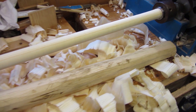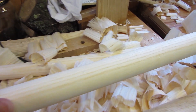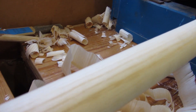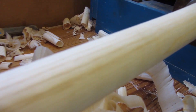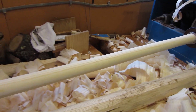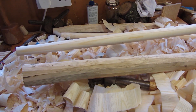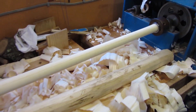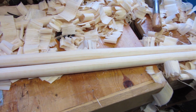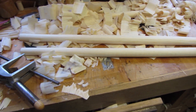I've roughed out this leg now so it's all been prepared at least roughly. You can see it's actually got a very good smooth finish. There's a little bit of rippling on it but really a little bit of scraping and it's pretty well good as it is. Next to it, just to illustrate, I've put the other leg that I'm now going to draw knife and smooth up in a similar fashion. Then I'll have a pair, which is what I need. Lots more shavings, but I needed two legs. So that's the rough turning now done for the rear legs.